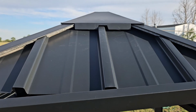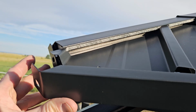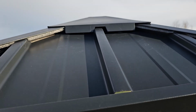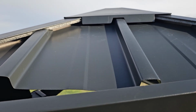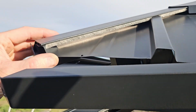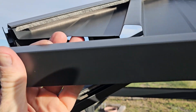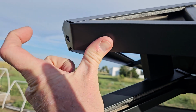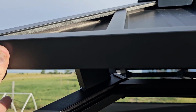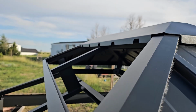And here's a little tip for you. When you're on the roofing portion of it right here, the easiest thing to do is, on one side, go ahead and just release this area over here. Then you can easily fit your roofing panel up there. This is for the top roofing panel portion. This side is screwed in tight, but this side is loose over here, and that gave me perfect access. And then I put these back in, of course, the roof back in the channel, and then I'll put my little bracket on there as we did in the previous step according to the instructions, but it's just easier, in my personal opinion, slipping on the roof panels in the top section of it here.